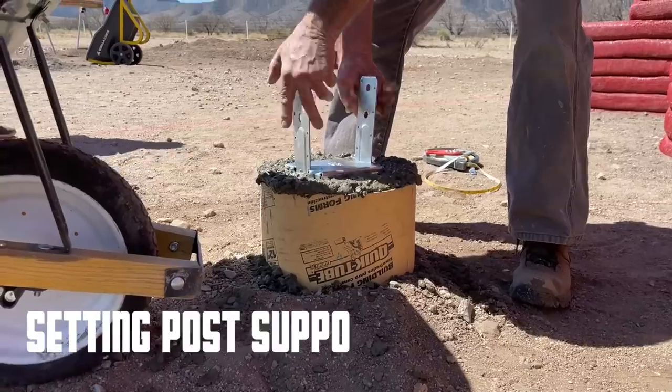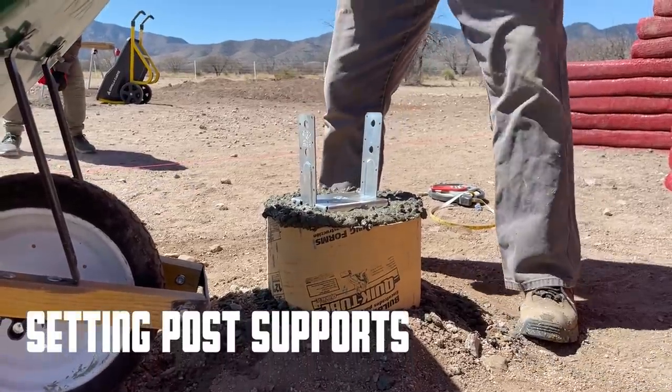For some reason, we decided to take a rectangle and a circle and offset them, which left huge holes on each corner that needed to be supported. It made really cool shade areas and overhangs. We were spinning out trying to figure out where each post goes — measuring front, back, left, right, and the right height. We were stressing out a lot, but we got it figured out. Got our holes dug, and we even poured concrete in the holes with a 12-inch sonotube form.